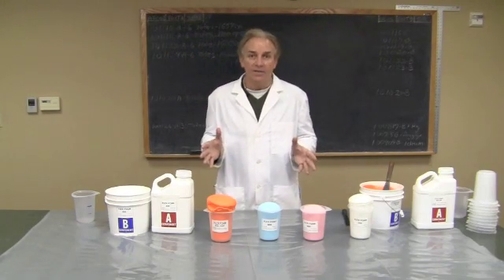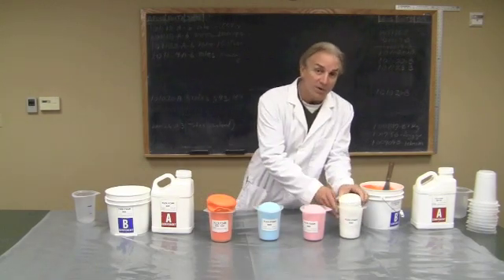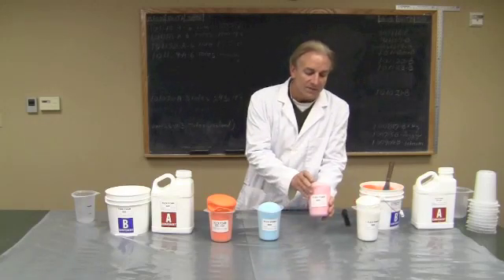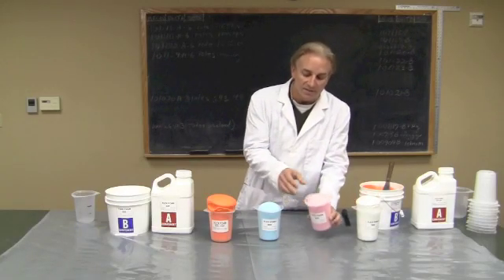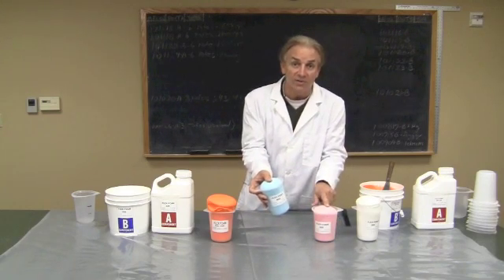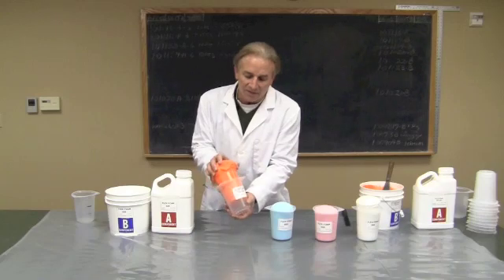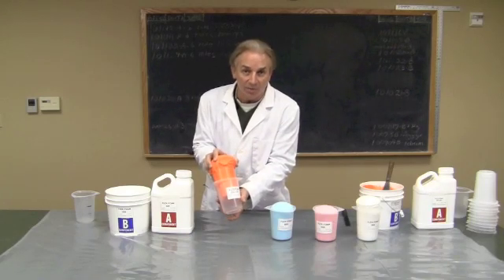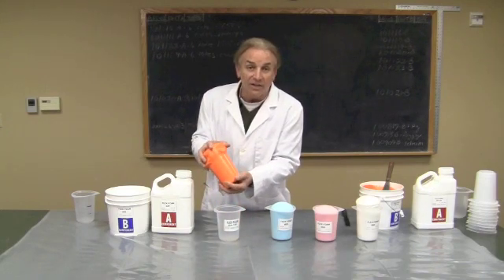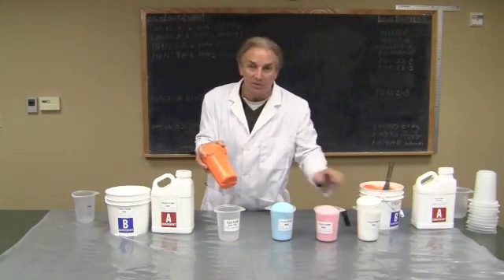We offer four different grades of the flexible foams, starting with our FlexFoam 300, which is three pounds per cubic foot. Our FlexFoam 600, which is a little more dense. FlexFoam 800, which is eight pounds per cubic foot — and the FlexFoam 600 is six pounds per cubic foot density. And then finally our highest one, which is the BA-100. This is going to be about an eight to ten pound per cubic foot density foam, but the unique thing about the BA-100 is it's called an integral skin foam.